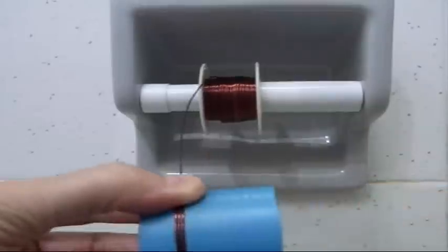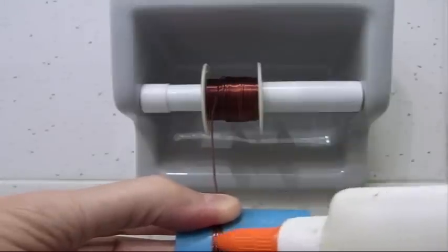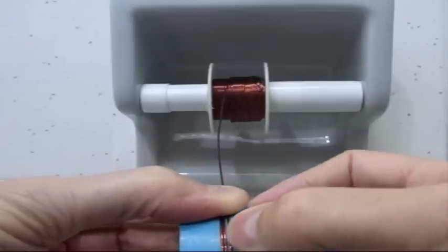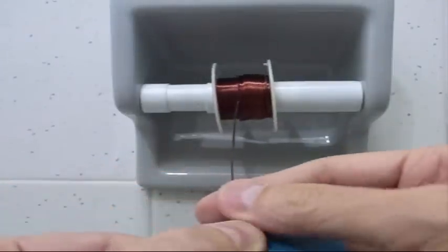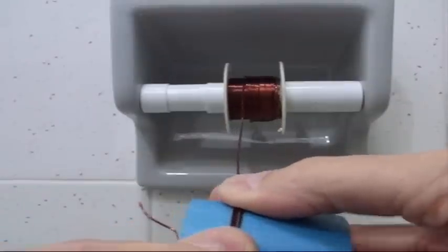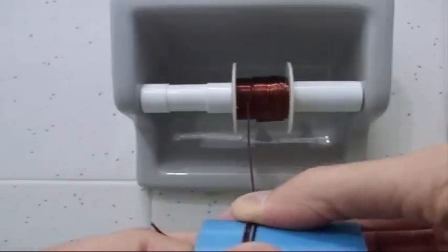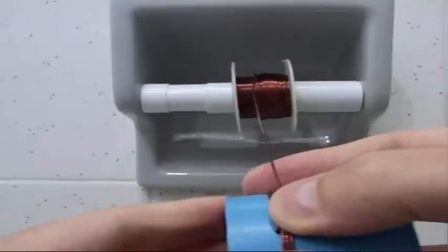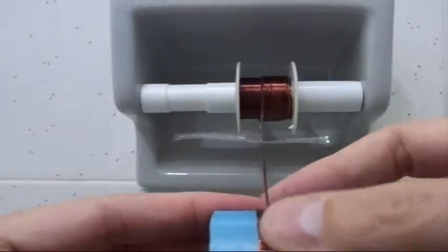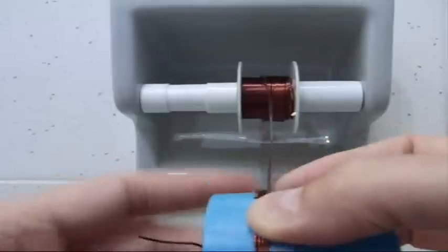One trick that helps hold it together: put a little bit of white glue on here and spread it out as you go along — it'll help stick to the coil. One problem with glue is you can get little balls of glue underneath the wire and it will not lay out nicely. Keep the wire tight — you want these coils very tight. Notice what I'm doing: I'm pushing the wire this way and turning it at the same time. This is why you need both hands to keep the tightness.